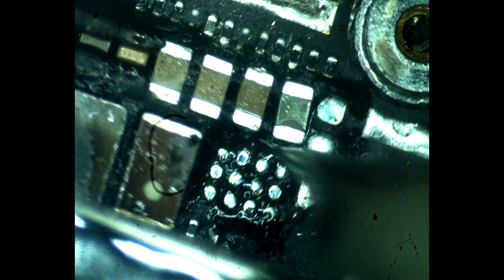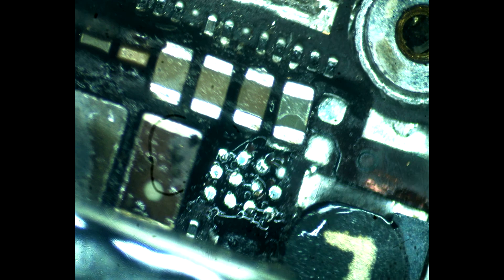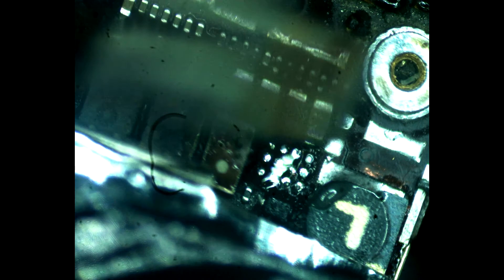You can buy it without a problem. When desoldering, you can also take this chip from the motherboard of an iPhone 5s, and it is much easier to desolder it from there because there is no adhesive and no underfill. As you can see in the recording, this chip is rather standard.